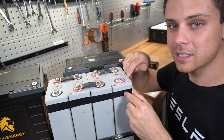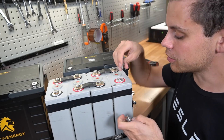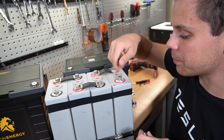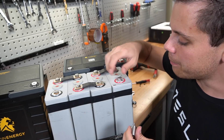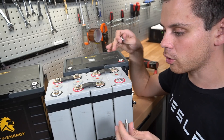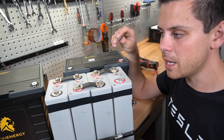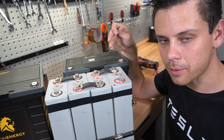On a proper cell, the terminal is attached deep into the cell to the structure of the lithium iron phosphate lattice, so you can tighten it down pretty well to the spec on the data sheet — and it feels much stronger. We actually have people on our forum with the new aluminum-cased cells with small screws who have stripped them out. So this is actually a real problem.